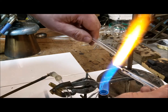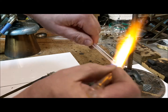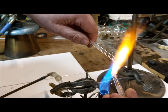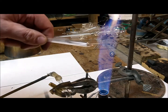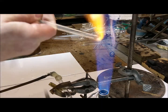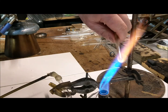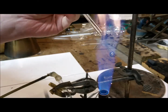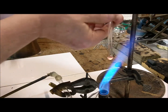We'll use our holder, once that's gathered up a little more, to take off the extra glass on the tip — rotating both pieces, keeping everything central. So now our ampoule base has a nice clean little tip, not too much glass on the end. Now I put it back in the flame and melt it all back in and start to give it a blow. We're going to do that a few times until there's a small blob on the end that has an even wall thickness. Once you've reached an even wall thickness, you can press it onto something flat and start to make a flat base.